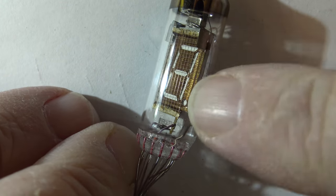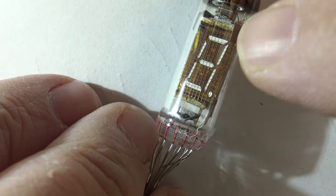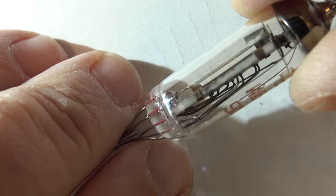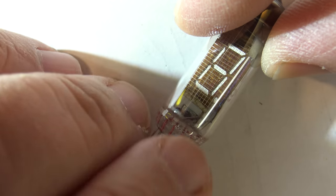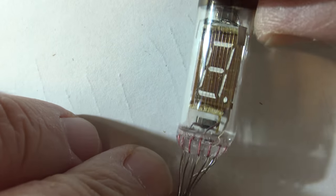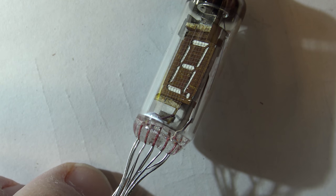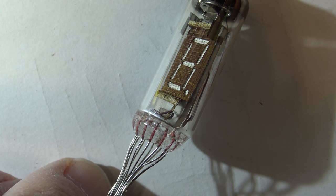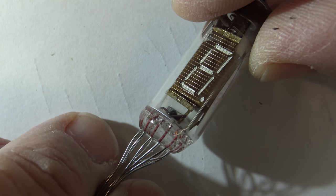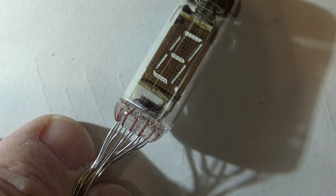The Numatron tubes look very similar to this but they're not a fluorescent display — they're actually made up of incandescent filaments, so they operate at a low voltage. These VFDs operate at a higher voltage, typically 50 to 60 volts, because it's a vacuum tube. Interestingly, people have actually used these as a triode tube for amplification since you've got a filament, a screen, and a plate.